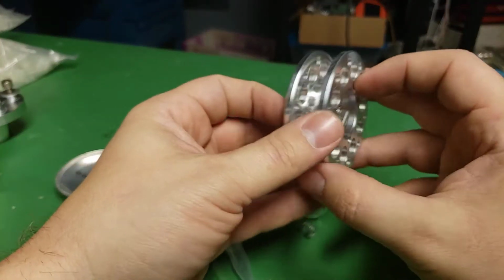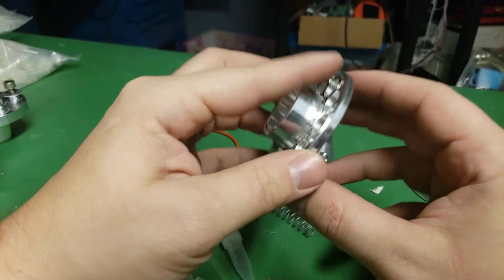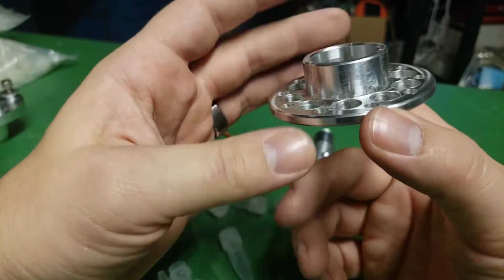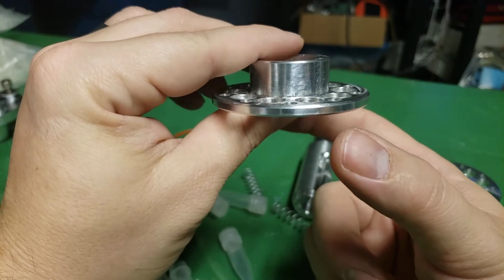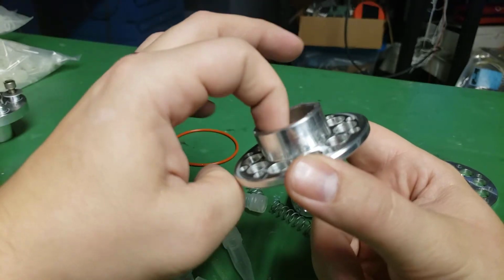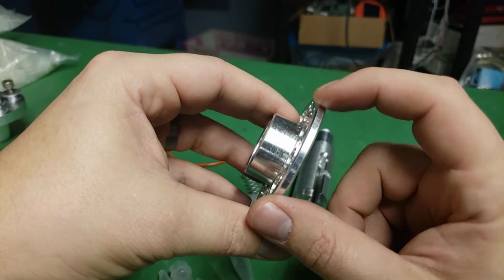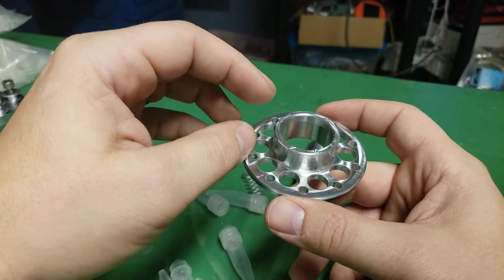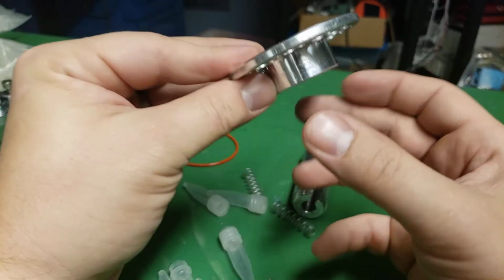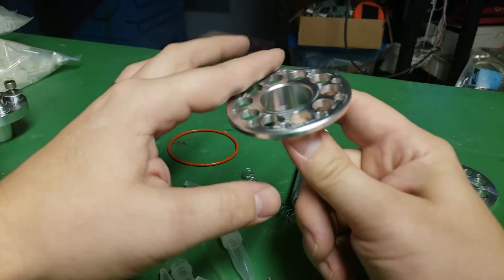So this is the vial carrier. Again, very similar operations for machining these. I held the material below the part. I machined this top, did the hole through it, did the drilled holes, put a chamfer on it, and then I flipped it and held it by this cylinder to machine this backside.